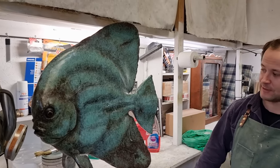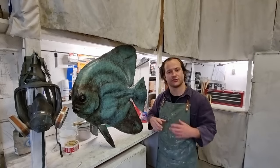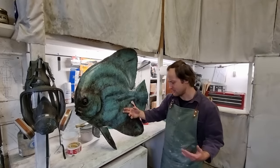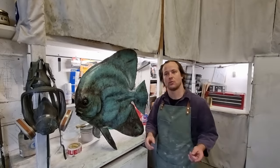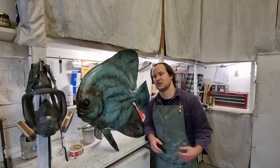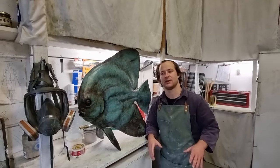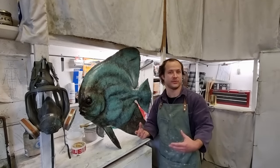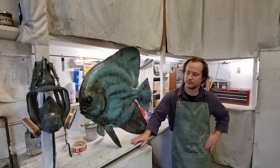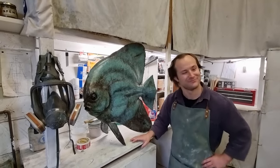About two months, I'd say. You have to take into account the process of making the mould, which is the initial process after you sculpt it. Then you create the edition — in this case it's eight casts, and each cast will take about a month to complete, maybe more. I use a foundry to do the actual bronze pour — I don't melt the bronze here. I send the waxes to the foundry and they cast the bronze elements for me, which I then weld together here, finish and patinate. This one is actually for retouch — I think the patina is a bit dark and I want to make it brighter.